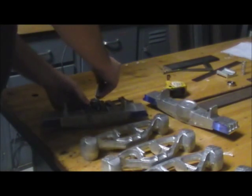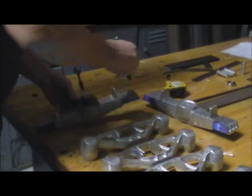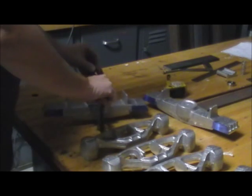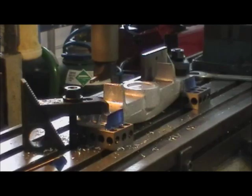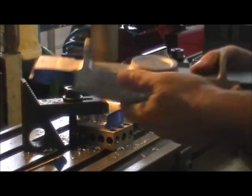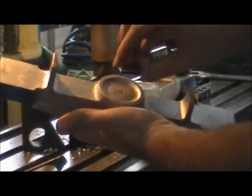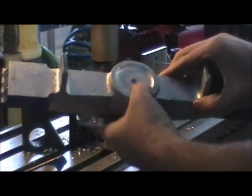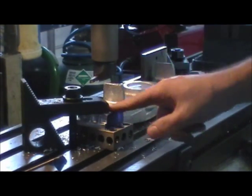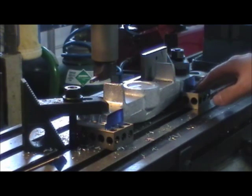So what I can do is put that on there, take two machinist clamps, and set it up to drill. Okay, on the truck bolster — we got the other one here — we found our center based on the jig we used, off the outside here, and we drilled through — just drilled through a quarter inch — just to give me a start, something I can use later on. But I found that the casting has an uneven top, of course, so we're going to just machine that flat based off of our reference points that we have here.